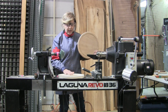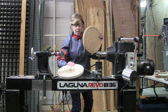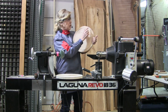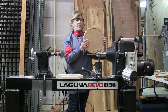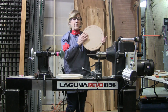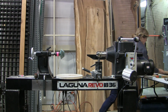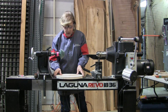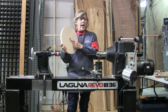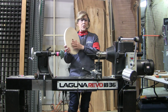I've already drilled my hole where he drilled his on the lathe. Let me go ahead and show you this. We're going to just do the step. Charlie brought a dome, and we're going to be fitting that in the groove to hold on. You can go ahead and pass that around to Ed now. Okay, I'm going to be expanding this. I drilled the 1.5 inch hole, and I went 3/8 inch deep.